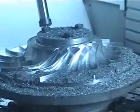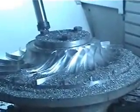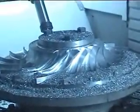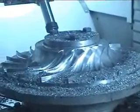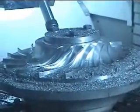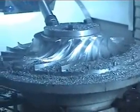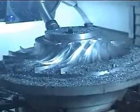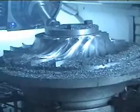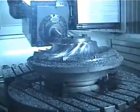Once we finish roughing, we need to recheck for the center in order to be more precise. Because the part does move a little bit — very few, ten thousandths of an inch off the center. That's natural with roughing, and prior to doing the finishing, we will check for that in order to make a better part.